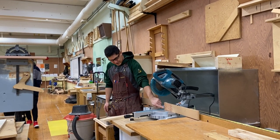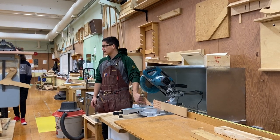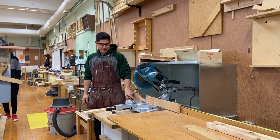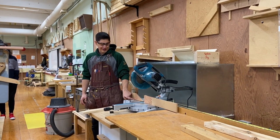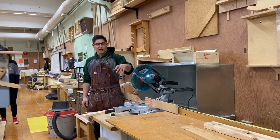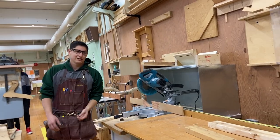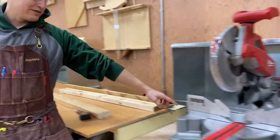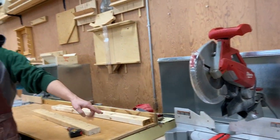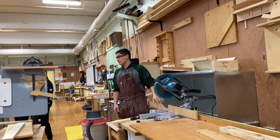On this saw, you'll see there are two lines here. Six inches is this line, but most miter saws have their own measurements. This one has a little no-hand symbol and a line here — this is actually about seven inches. The standard for all of them, like this one over there which has a little ring going around and a no-hand symbol, may be a little bit closer. But we need to make sure that we stay at least six inches away.